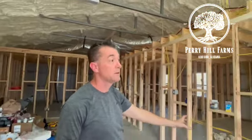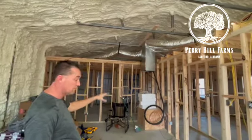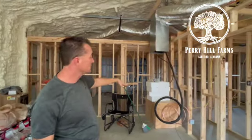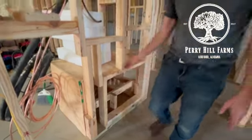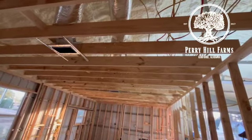Air conditioning is set to come. I had to restructure and rebuild this box. Dennis, who's doing our air conditioning work, told me the dimensions. I built it, but I didn't build it quite right — he said I really need the box on top and the vent underneath, where the air is going to draw and we'll change the filters. They needed the unit above it to cut a hole through and pull the air through. They got everything they need for air conditioning — they came in and did all the duct work, which was a blessing.